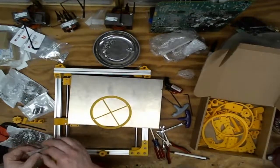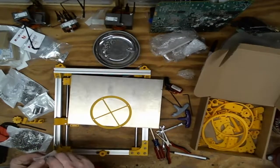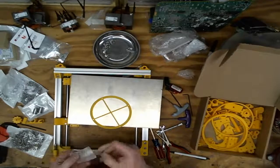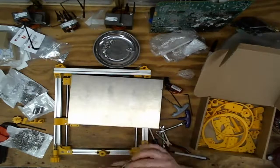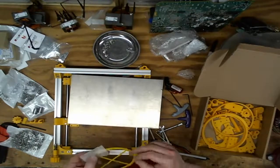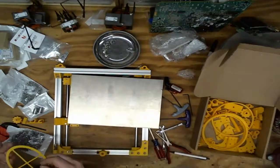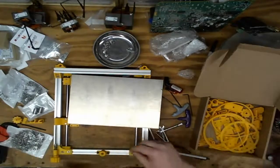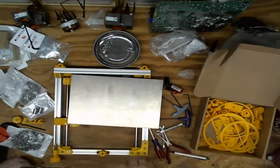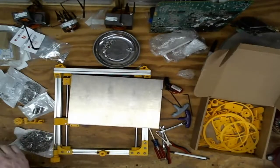So this is the bearing they call for, and it's almost the size of the head of this. It's supposed to clamp down on this piece, which spaces it up the right height. I'm going to have to do some checking. Maybe these are flatheads, in which case I have to make sure I have some M3 flatheads. Deep thoughts.